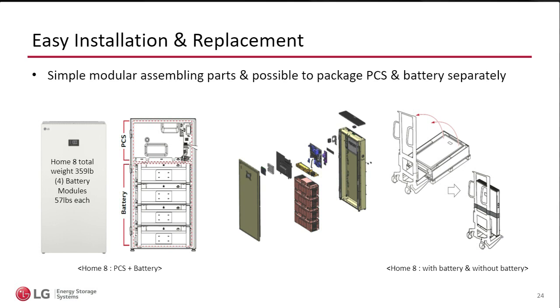But we've made it really simple. You don't need to worry, what do I do with this red one? What do I do with this black one? Where does it go? It's a harness. It's a wire harness. There's no way to make a mistake. You just plug it in, daisy chain. Plug it in, and you've done the electrical connection. It has a built-in 40-amp breaker and one that you can't see, but it's a fuse in the back, and that's the protection that we need.